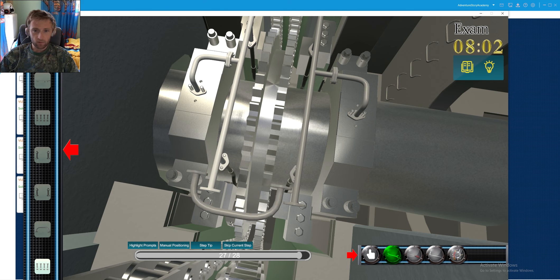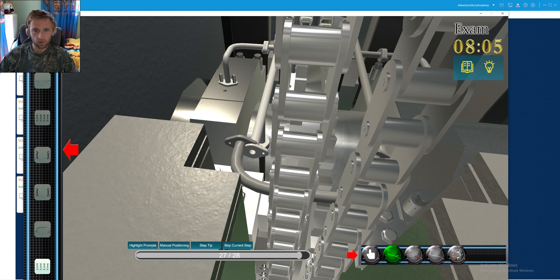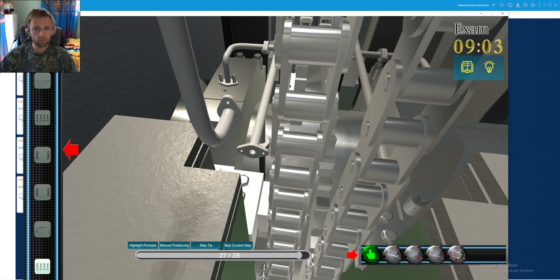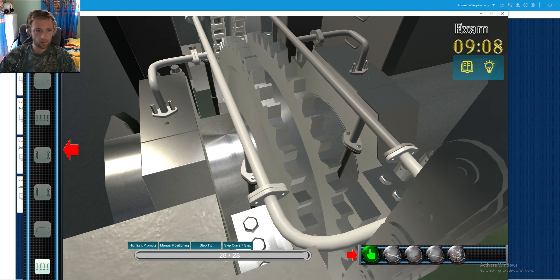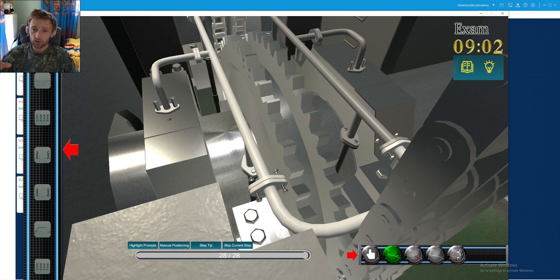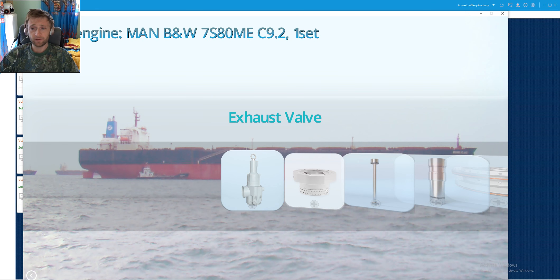I hope you liked the live stream we did about two days before. We will make more of these videos together. I will bring this pipe into position. Most of these bolts will also have lock wire, because these bolts are inside the engine near bearings and piping, and as much as possible they need an additional locking mechanism.